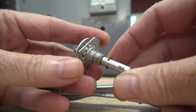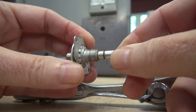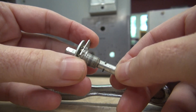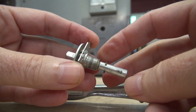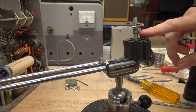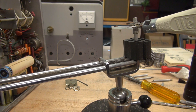I've got that clip out of the groove, but that shaft is not moving. So I am going to apply some heat, put this in a vise, and see if I can get her apart. There's also a little burr here on the shaft — I need to clean that off before I pull it through because I don't want to damage the inner surface. I've got the switch in the vise, so I'm going to heat this and simply push down on this base. Hopefully she'll come loose.